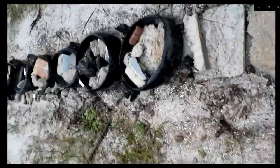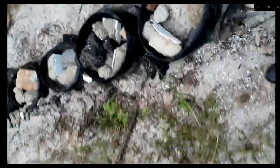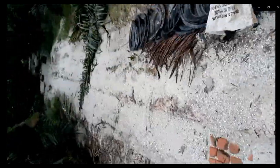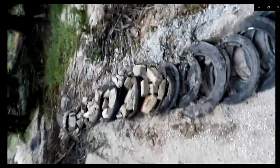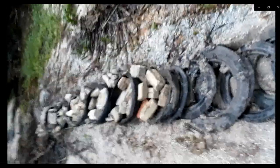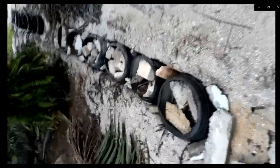We add some brick, stone, and sand — as shown here, we've already added some bricks and will cover with sand later on. These old tires are placed along the track where the lorry tires run. As you can see, there are more tires filled with bricks and stones, and we will cover them with sand just like this.